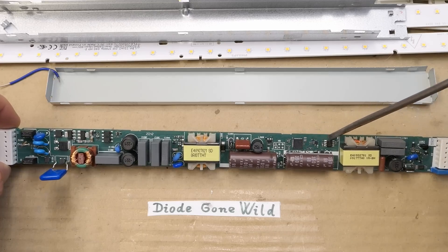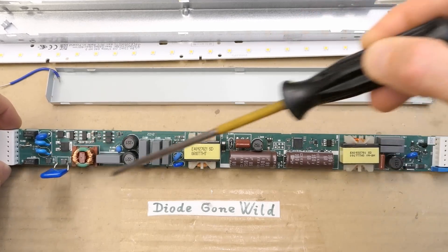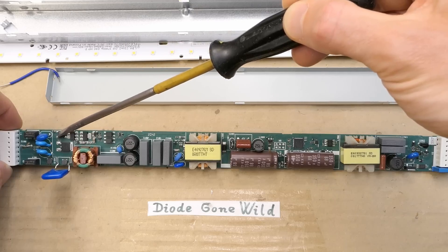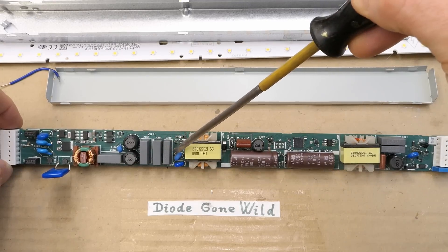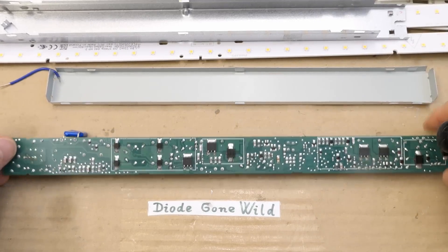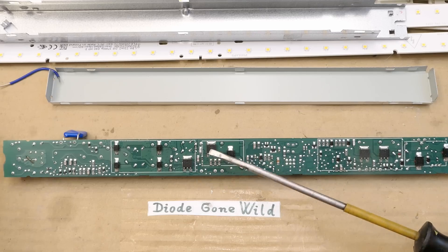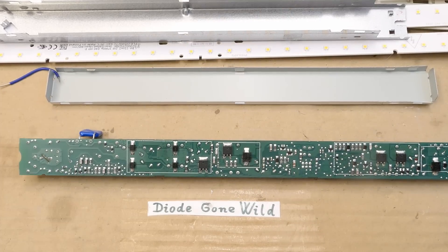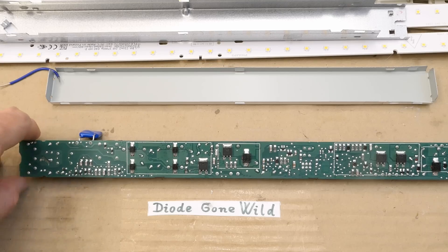Here's some chip, another 8-pin chip. It seems to have two fuses: 3.15 amps for the main thing and a 1-amp fuse for some sort of control interface. There is also a bridge rectifier on it, two optocouplers each facing a different direction, and an NTC thermistor for inrush current limitation. It seems one of these two transistors bypasses it.